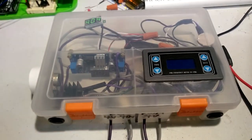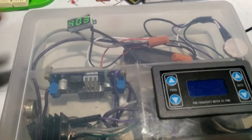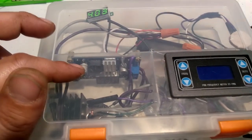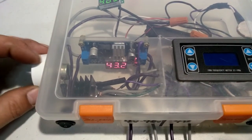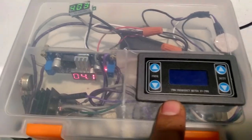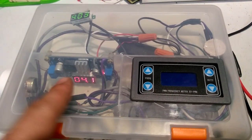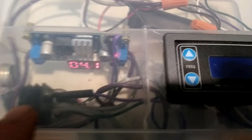So this all came together as I can just use a 4 volt or so battery bank, easily rechargeable, to drive this boost converter to get anywhere from a 4 to 40 volt or so output, and I can also use this little board here to pulse modulate loads using this output from this converter through this little transistor.